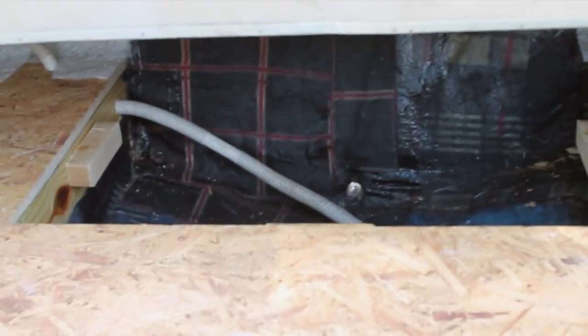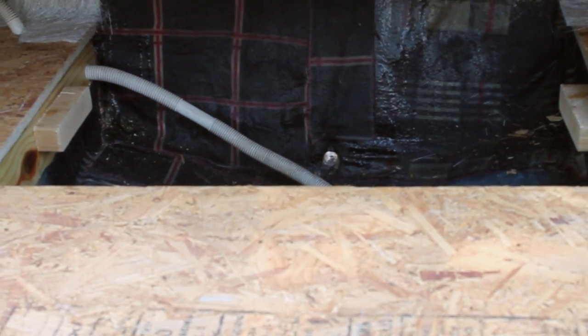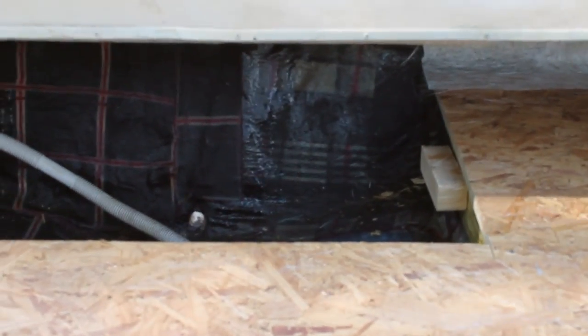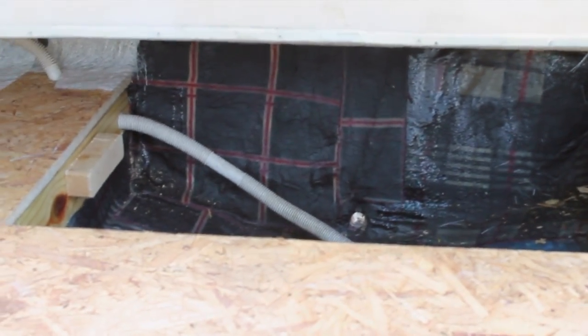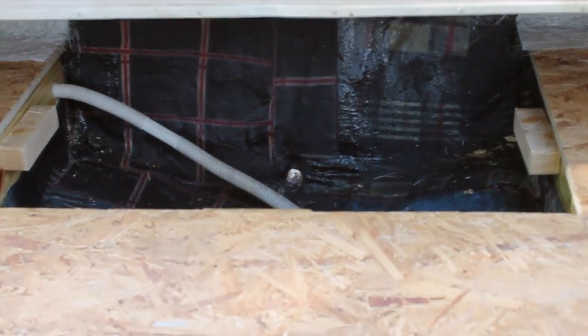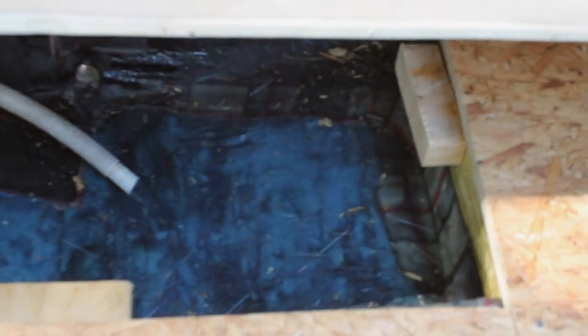And the one thing that I will do, I'm going to paint the bilge, because as you see, the pattern on my fleece blankets doesn't match one another, because I was just trying to pretty much get it up there. I got chop strand on the wall, then I got fleece blankets on it to reinforce the transom, make it a little bit sturdier. I re-tapped out the drain hole down there. Got fleece blankets on the keel or the hull all the way down in the bottom. Tapped that all in. It holds water perfectly. There are no leaks in here at all. The only water that comes out is through the drain hose, so that's pretty good.